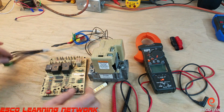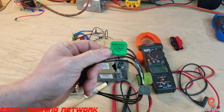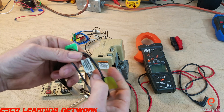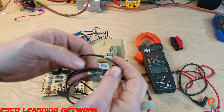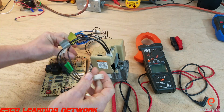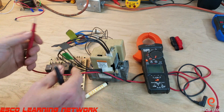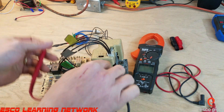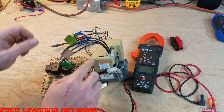The first harness I'm going to show you has four wires and it goes in series with the board and the valve. The four wires are clearly labeled: one is for the orange wire, the EFT output; one is for the blue wire coming from the pressure switch; one for the 24-volt hot; and one for the 24-volt common. If we look closely, each one of these wires has a portion that's been peeled away — stripped — so that we can do voltage testing. We plug it in here, and the mating harness from the board plugs into here. These areas are in different parts of the wire so they won't touch each other and short out. We take the meter leads and test by placing them on the stripped portions to test for voltage without having to stick leads into pins or harnesses and damage anything.